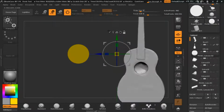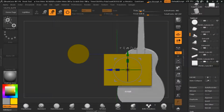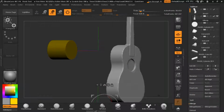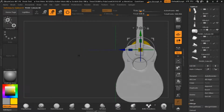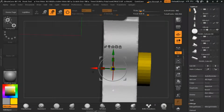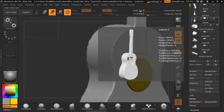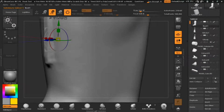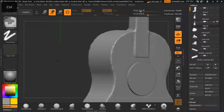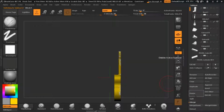All right, anyways, with that said, as I'm fixing that, my next project will be trying to get that auto bed level to work, where I'll be working in Fusion 360 to get the proper dimensions. Since it's not really a very creative project, but it is such a necessary project, I want to be able to use the whole bed, the whole 120 millimeter diameter that I have available to me, without having to worry about an inconsistency in the bed. And for this particular printer, a servo auto level is probably the ideal tool for that, because I've got a heat bed with a metal plate on top for the Delta printer.